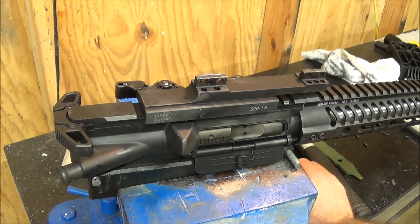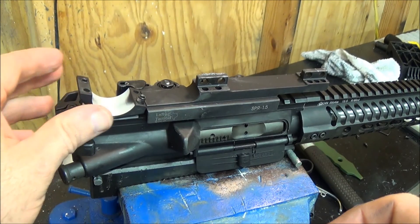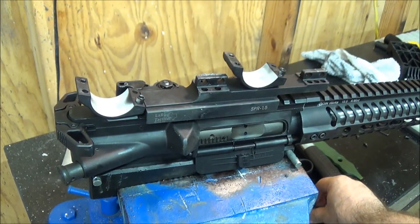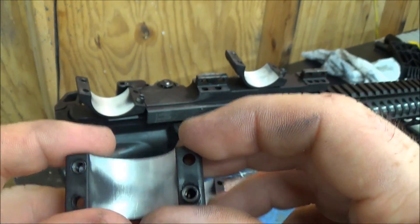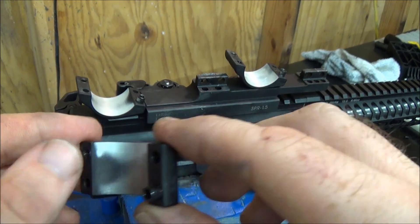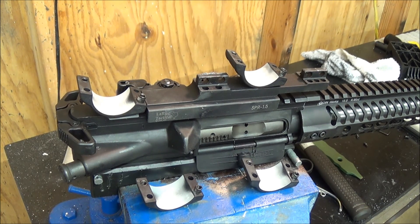All right, I've got them washed and cleaned up. You can see where your low spots are — everything is now parallel to every bearing. See how each one is different? That shows you the inconsistencies I was talking about. These are matched to their mates, so remember which ones went where — which bearing to which bearing cap. I'm not too terribly worried about those low spots because the main surface area on all four bearings is for the most part uniform. I'm happy with it. I have a true straight surface to torque down my scope and I'm not skewing anything inside the lens.